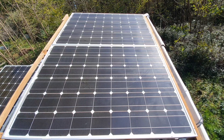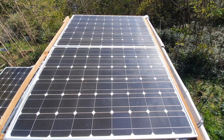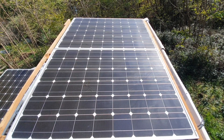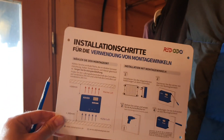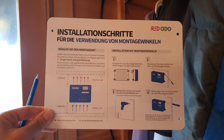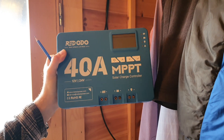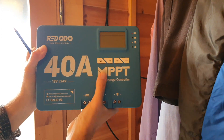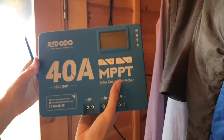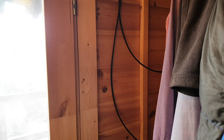Keep in mind that with pretty much any solar system, you'll be sourcing some products yourself — for example, the solar panels. It's actually quite simple to install. I decided to use the mounting brackets because it allows for more ventilation and a much more solid fixing. You can also use your own screws and mount it however you want, but I just mounted mine in a wardrobe space with the battery below. I had to get a five-metre cable to connect up to my solar panels.